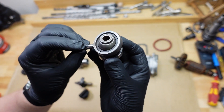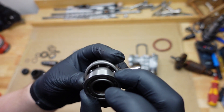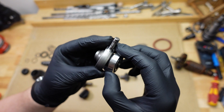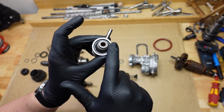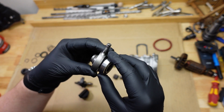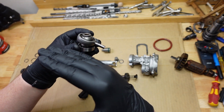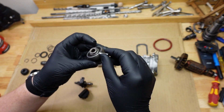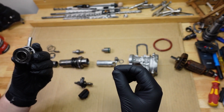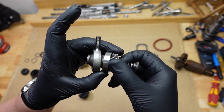That is a swing bearing. You can see it's a wobbly sort of structure — basically a ball bearing. You can see the balls in there, beautiful. But the bearing race, the slot where they run in, is actually cut at an angle on this little globe in here. If you think like an orange — instead of cutting an orange in half along the equator, you cut it at an angle, and then that actually becomes your bearing race where the balls run in. As this thing rotates, that translates the rotary motion into a linear motion.